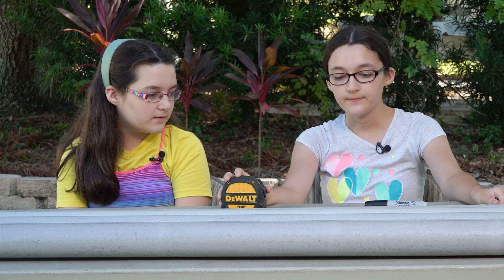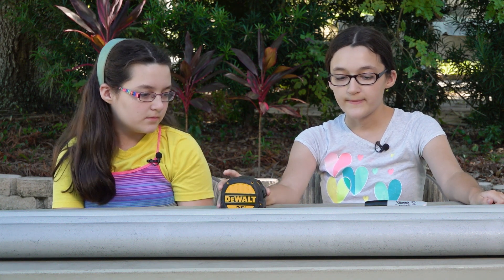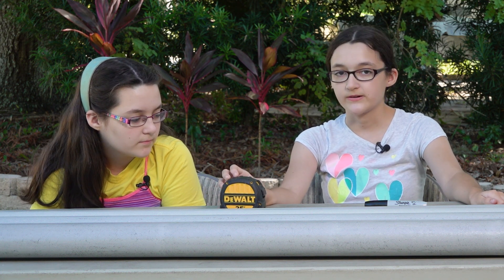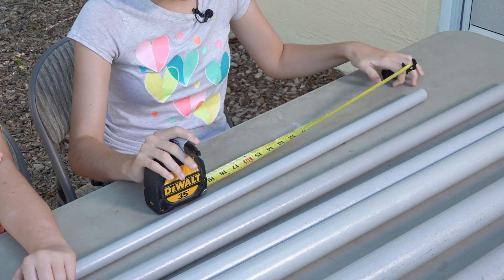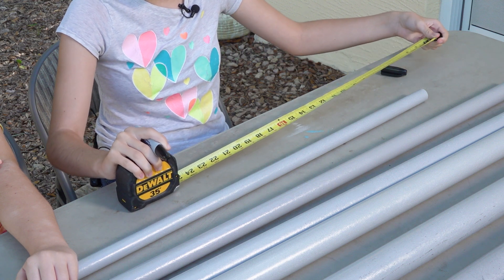The instructions say to mark them at 12 inches, which would put the mast at 36 feet, but we want it to be more sturdy and we want the mast at 33 feet, which is where we want to put our TN07 X-beam — the one we used at the Dry Tortugas. So we're going to mark them at 18 inches. Let's get started. I'm going to extend this so you can see where I'm marking it at 18 inches.